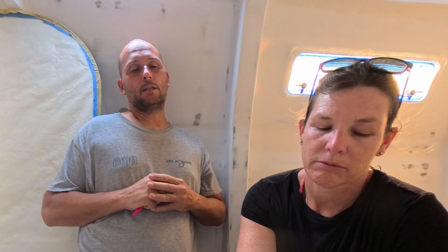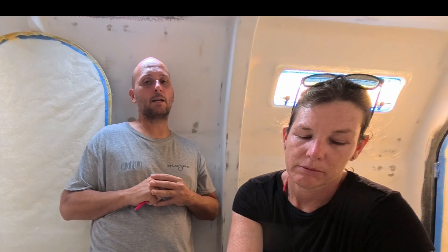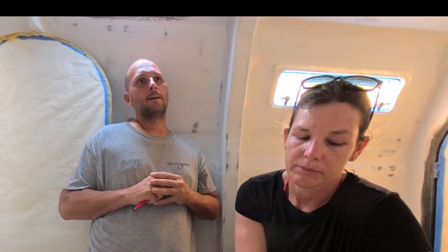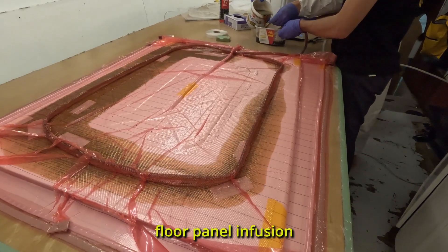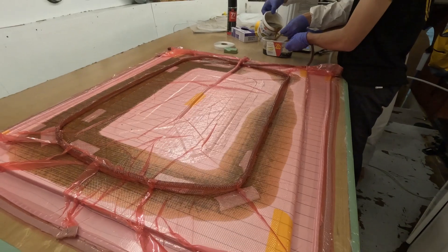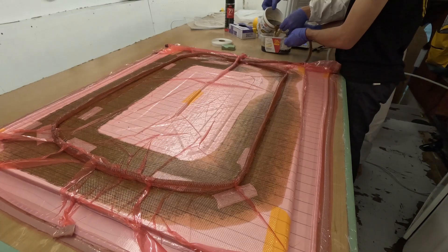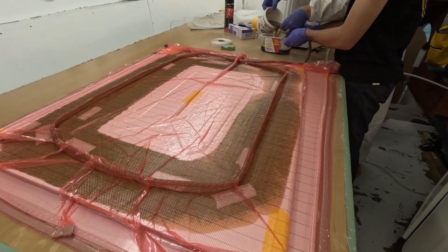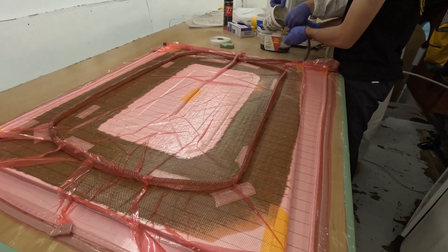Would it be possible to use a less dense core foam and just make it a solid part? This is a good question and comes back to a lot of experience. I've infused a lot of parts over the years and we've learned what density works. At 80 kilos you're pretty much safe as houses infusing on it — you're never going to crush it. 80 kilos is the standard and it's very workable, quite tough, and you won't crush it.